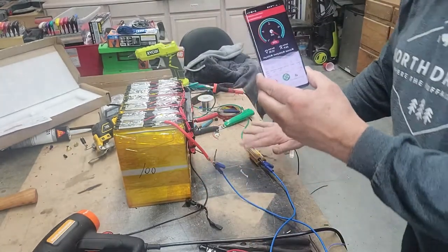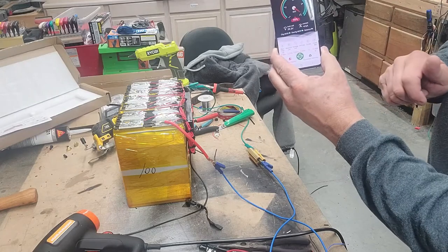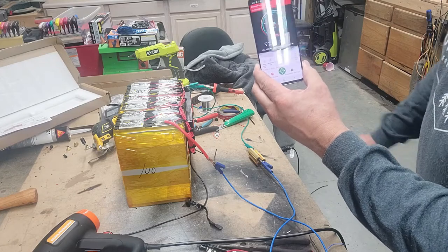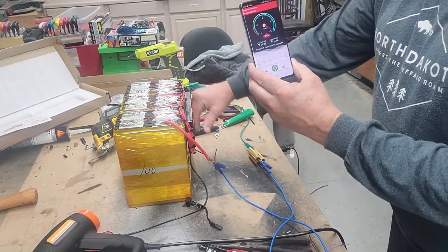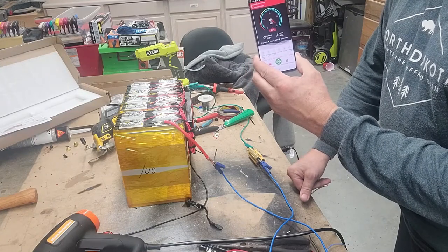So we're looking good. It's getting a little warm, which it should. 36 volts times what, 4? Almost 160 watts. 40 times 4, 160. So yeah, looking good. DALY BMS nice and cold. Battery's charged up. I would call that a successful completion.